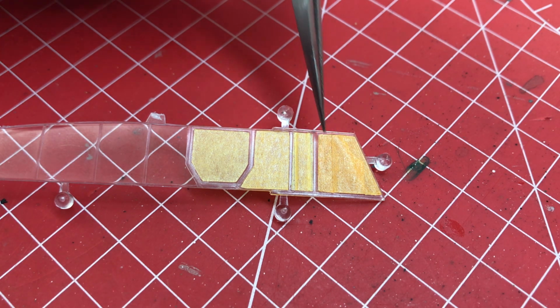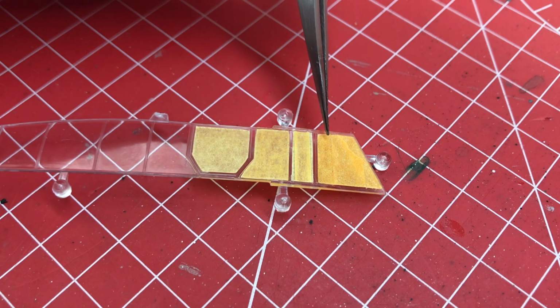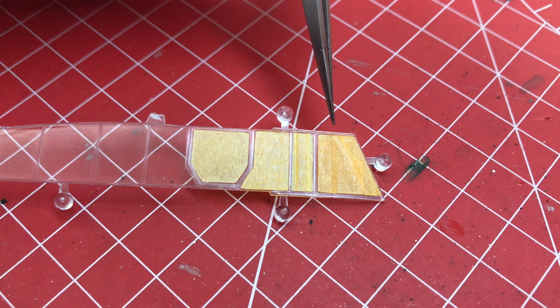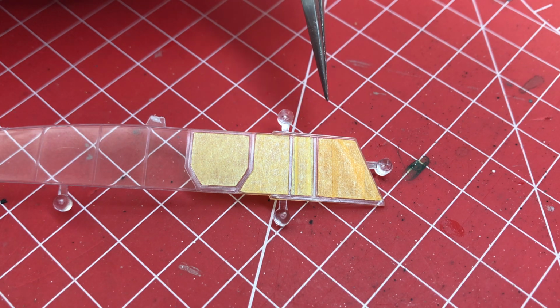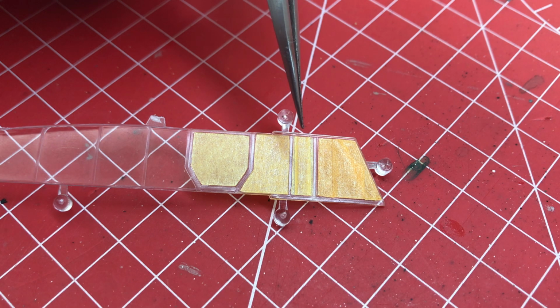And the reason for that is the more layers you have on, the more build up you get against the edge, and the more likely you are to get either paint bleeding into the glass or the paint not getting onto the area that you want to paint crisply, and actually end up with not doing a neat job, and then you're cleaning it off and doing it again. So that's why I have that rule.